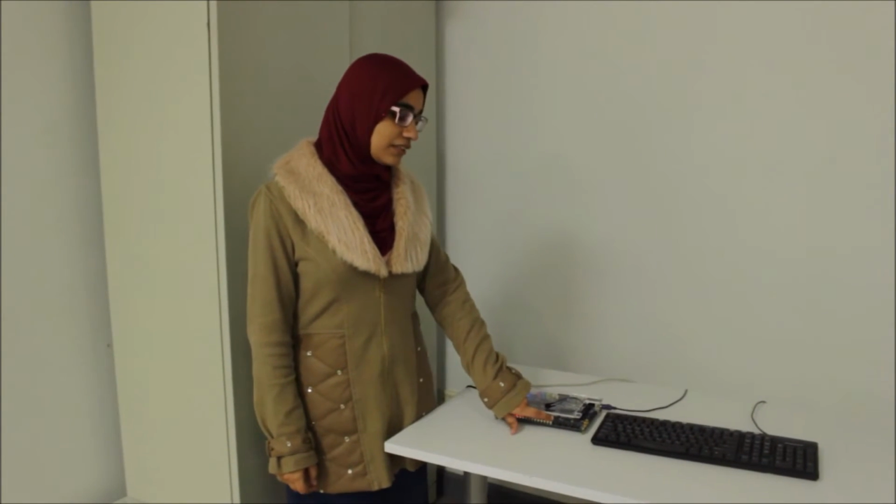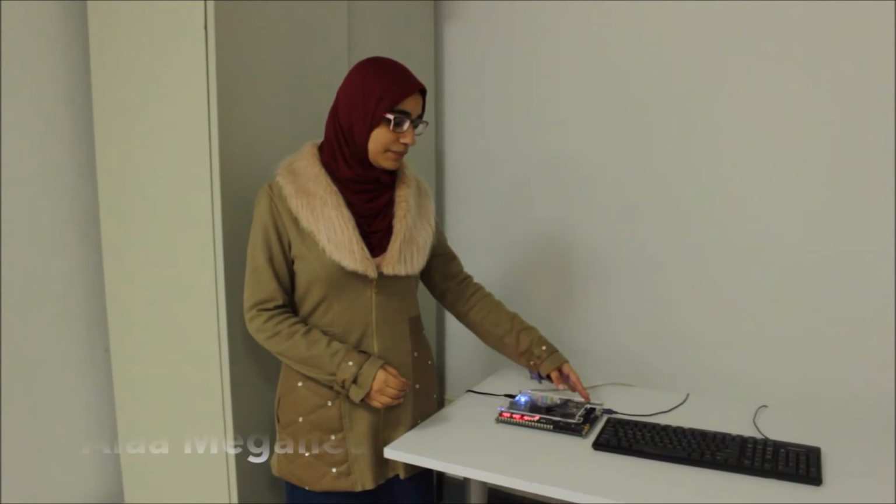So when this switch is on, we move to the other direction where we translate from Morse code to the alphabets. As long as this button is pressed, we send signals to the buzzer to simulate the sound of dots and dashes, and this delimiter denotes the end of the character we send. We designed a finite state machine to detect the dots and dashes based on the period of time this button is pressed. We use a threshold to differentiate between the dots and dashes. Everything below this threshold is considered a dot, and if it exceeds the threshold, it will be a dash.